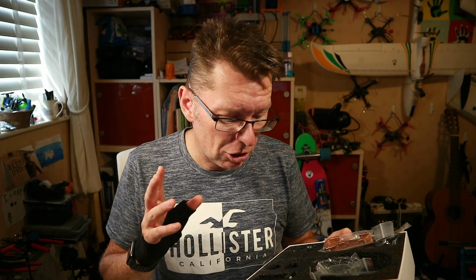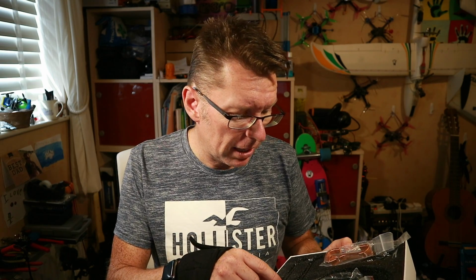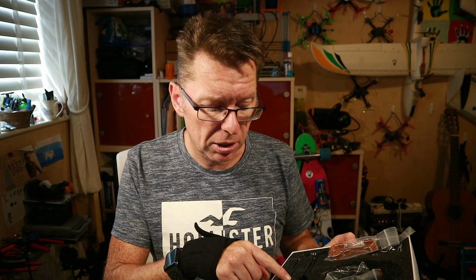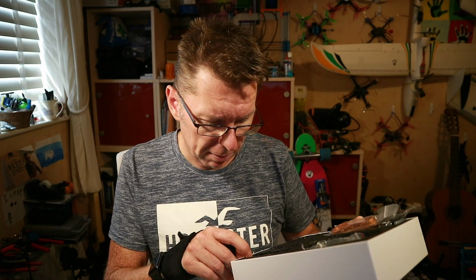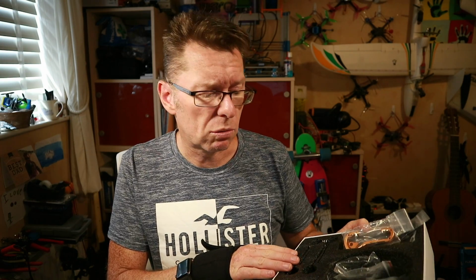There is an 11-page quick start. It said it was a manual, and then when you get to it, it says a quick start guide. So it won't hold your hand through it, but it'll give you the basics. And there shouldn't be much to do. It's mainly going to be solder the motors onto the ESC board, and I'm not sure if the rest of it's done with plugs or needs extra soldering. Obviously, you'll need a receiver, which you might have to solder on. I think we should just dive in and get on with it, shall we?